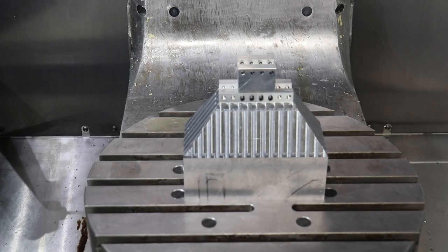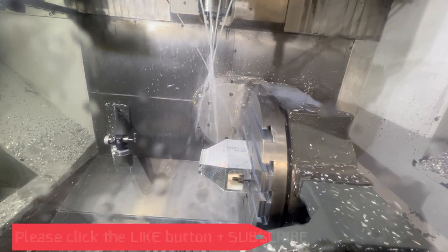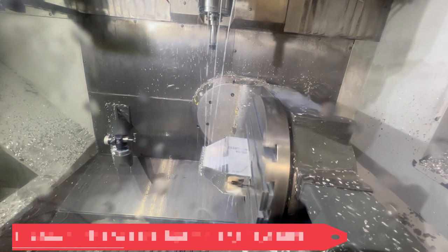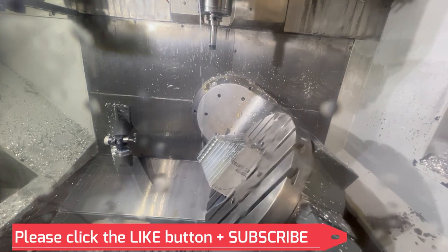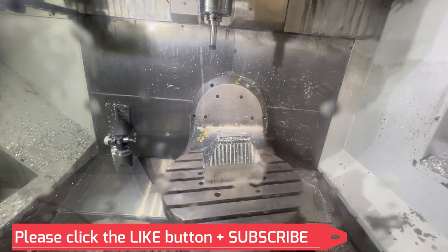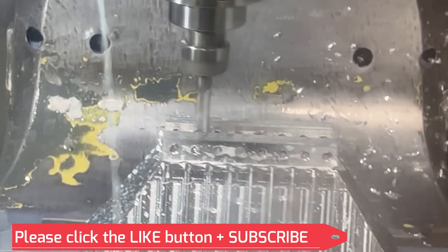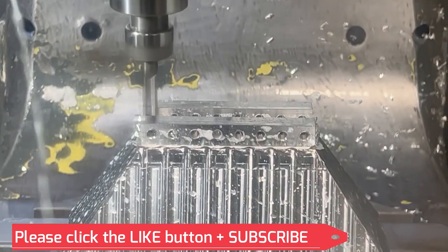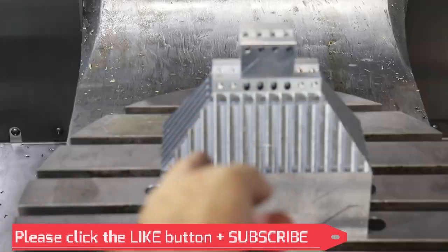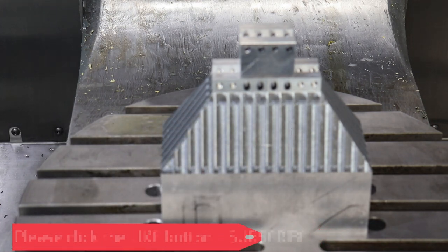Yeah, so this is the new work holding solution, and basically it's a pyramid machined out of a block of scrap aluminum. It's about 7 inches tall and 8 inches by 3.5 inches thick. And we've got a kind of pyramid top there with a slot that has set screws in it. And then an additional pedestal that is set screwed into the first set of set screws. Let me spin the table around so you can get an edge view.